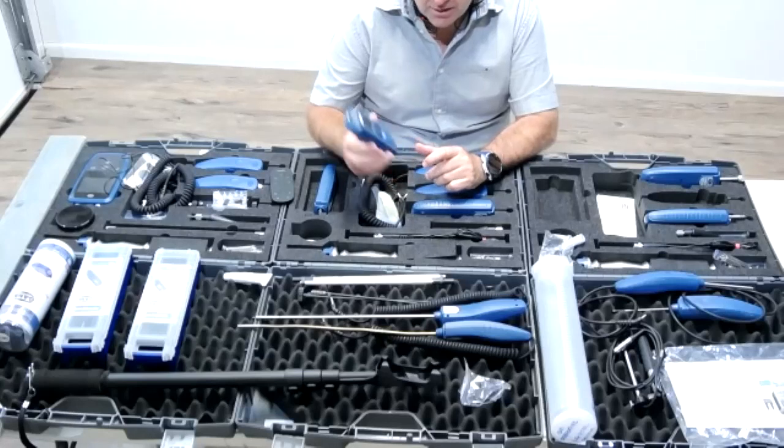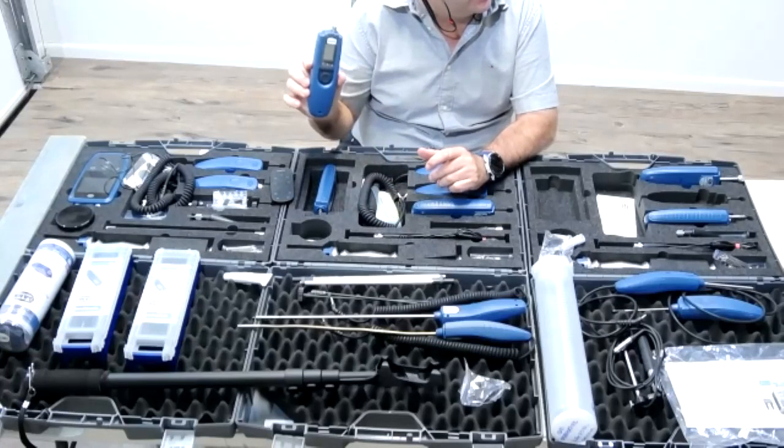Okay, all right. Well, let's move to the BLH40. Here we are, BLH40. It's a straightforward wood moisture meter. As before, you use the arrow down button to change the setting. You can select the wood species. Here it's set to 4. By pressing the arrow down button once again, you can set a temperature for temperature compensation, because temperature will always influence the reading.